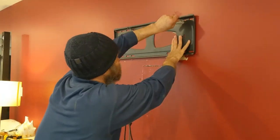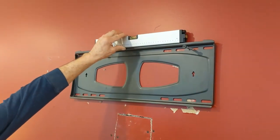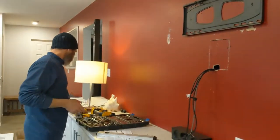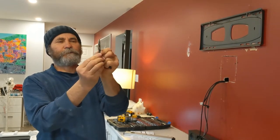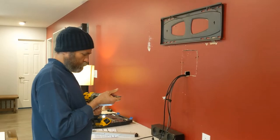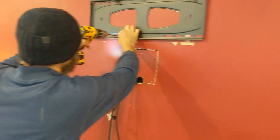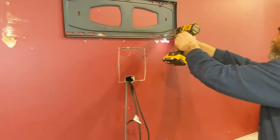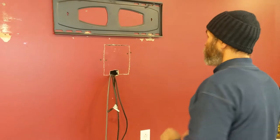Let me see if this guy is on level — I have this little level there. Yeah, level is pretty good. So I'm just gonna put those screws in there — we know where the 2x4s are. I'm gonna pick up the screw and find a drill bit that is a little bit thinner than the screws, and I'm just gonna drill a couple of pilot holes. We know the 2x4 is there because we had the old mount, so I'm just gonna go right in there.